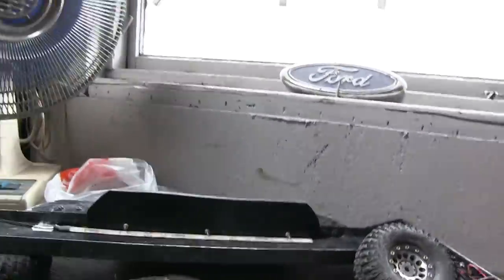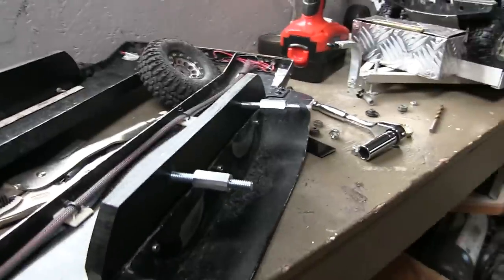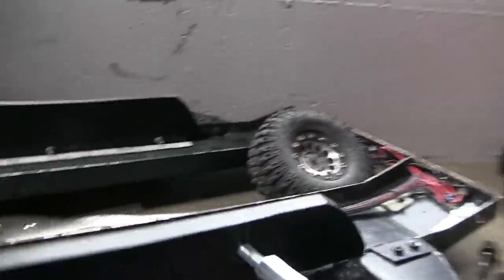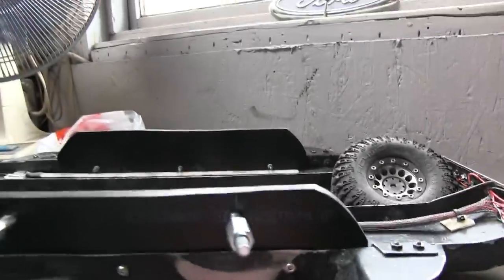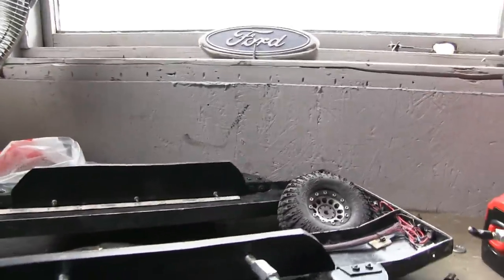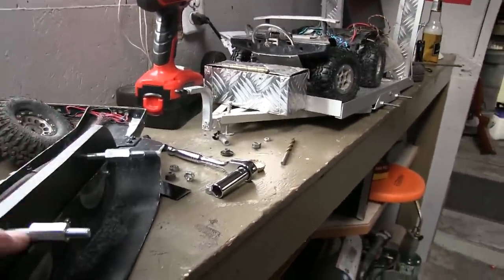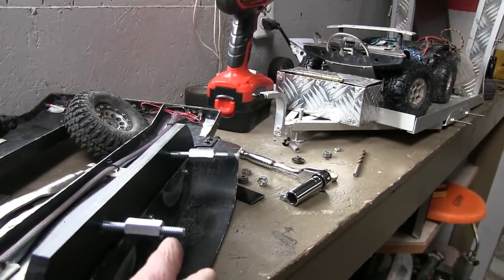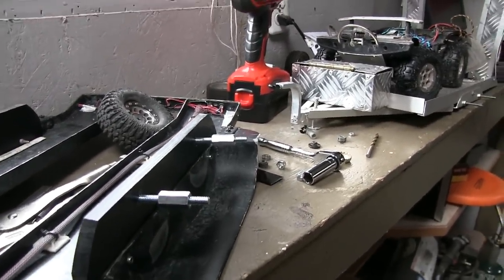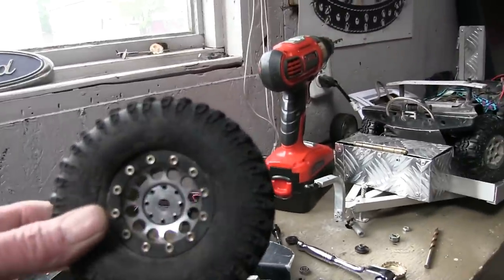So I decided to try something different after messing around with this long enough. I mounted a couple pieces of 3/8 Delrin to the side of the trailer on the inside so that it doesn't affect my fender depth. I've gotten myself a couple of carriage bolts to go through, a spacer, then a washer, then the tire, and then a washer and the wheel. No bearings, no nothing, no fuss. I simply drilled the hole in the wheel out a little bigger.